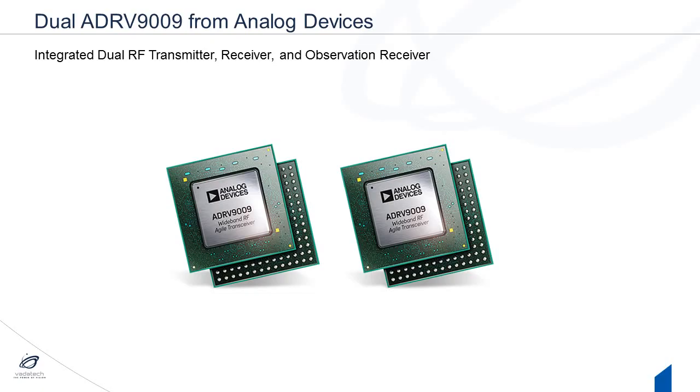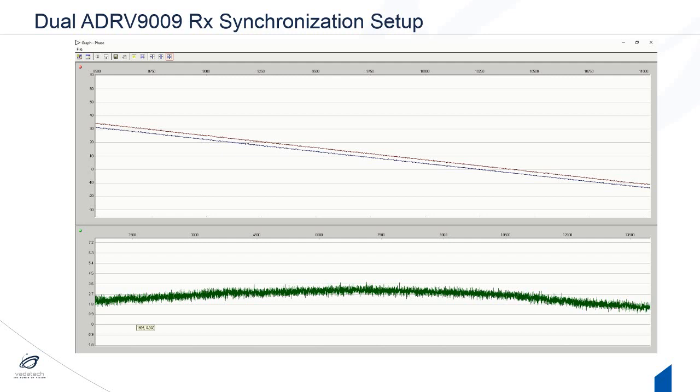So the goal of this ADRV9009 transceiver mechanism developed by ADI, and especially its phase synchronization as shown on the FMC239, is to reduce the complexity of the antenna calibration by initializing to a more constant startup condition with a deterministic PLL phase and LO divider state, to reduce the temperature dependence of the system phase synchronization and allow the antenna calibration to run less frequently during operation. In other words, the phase between each device is aligned within a few degrees at startup so that the phasing between the devices is considered fixed and can be repeated and can be taken into account at system level.